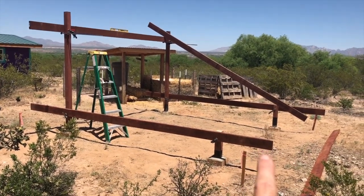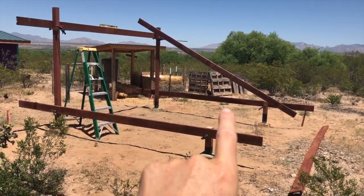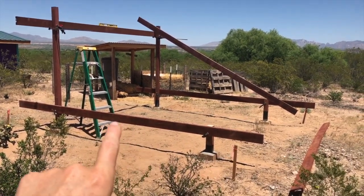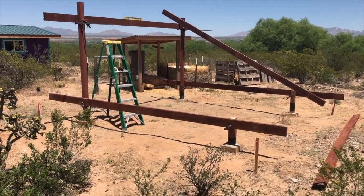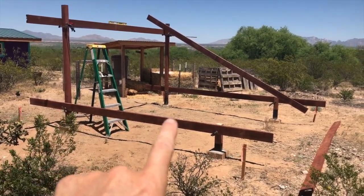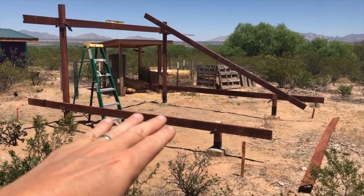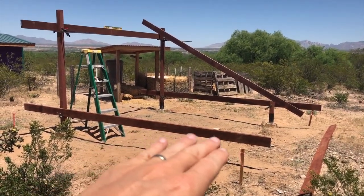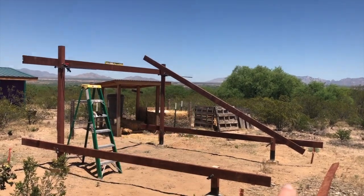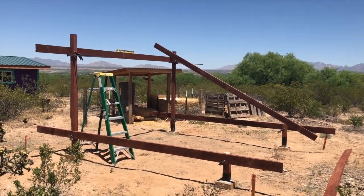What I did was come out here with these beams — everything is just clamped in place right now — and with these beams from front to back I've created basically a poor man's laser level. I clamped them into place, put a two-foot level on these, and made sure they were level front to back. So the point where these beams cross the back of these posts is level with the front — I can pretend that's a floor, essentially, nice and flat, kind of like the bottom of my SketchUp drawing. Now I can do some measurements and the slope is — drum roll — exactly 27 degrees, which is what I'm looking for.